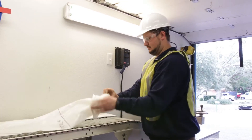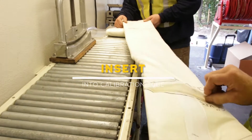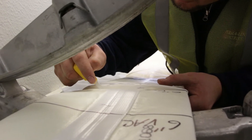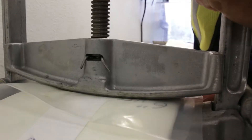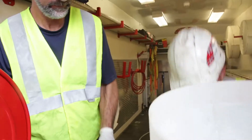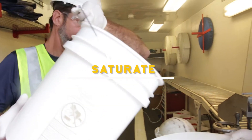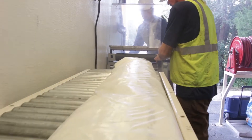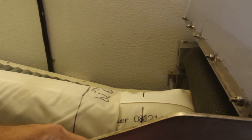The liner material is inserted into the calibration tube to the desired pre-marked spot where the liner will be bonded to the calibration tubing using a special plastic bonding adhesive. The liner material is then saturated with a proprietary blend of 100% solids epoxy resin that will ultimately form the new pipe inside of the damaged pipe.